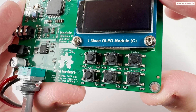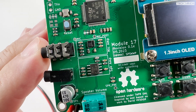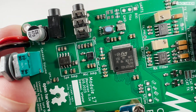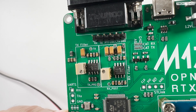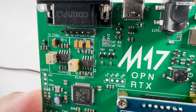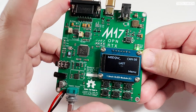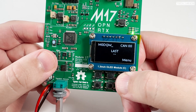With Module 17, all you need to do is add a Kenwood-style 2-pin microphone, a power source via the DC input or USB-C, and then a cable between the 9-pin serial-style connector and your radio. Pinout information is on the Module 17 GitHub page so you can make your own cables. I'm using Module 17 with a Yaesu FTM-300, and making the cable was actually quite easy. In terms of pins and wires, it's just audio in and out, and a way to control the PTT line.